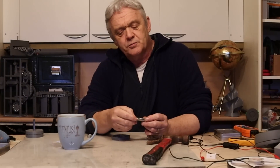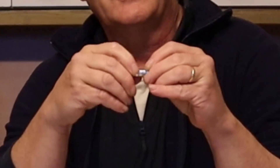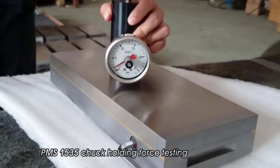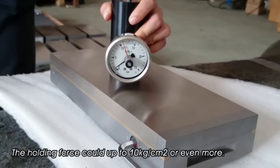How it works is one thing, why it works is another. The reason why it works is because magnets have a very peculiar property. If you hold magnets and try to pull them apart in that direction they're incredibly strong, but if you pull them apart by sliding, the force required is much much lower. So with magnetic chucks, all you have to do is push a lever — and not that strongly — to turn the magnets on and have that incredible gripping force to hold something down.